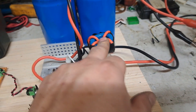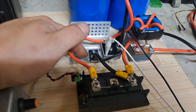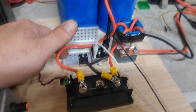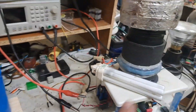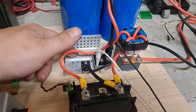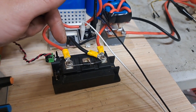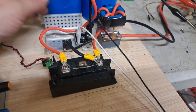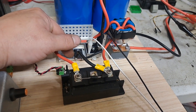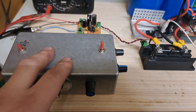I'm not sure at what point this thing is going to saturate, but I'm pretty sure it will at fairly high power. Before I had a couple of 60 and 65 amp IGBTs in parallel as the main switch on the buck, but for some reason one of them failed while playing around with this coil — I think it failed once I got to like 100 volts. I've now got this fairly large brick, only one switch on it is good, so that's the one I'm using. It's a 200 amp device, not anywhere near as fast, but hopefully it should be fine. I need to get this filter right — that could be part of it.